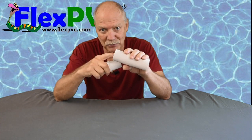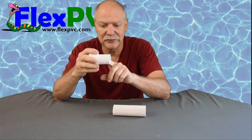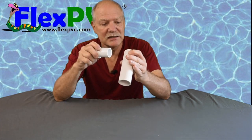If you're using inside fittings and it won't fit, that's why — it's your pipe. These fittings haven't changed, and molds don't change. We did try a different manufacturer and had the same problem. This manufacturer's fittings are a little bit longer and taper a little bit more, so they start a little easier, but still neither will go into this end of the pipe.